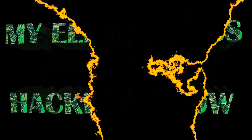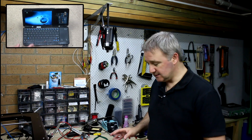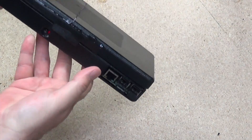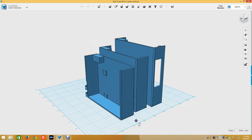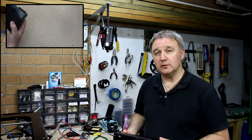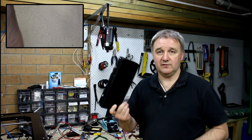Now for lessons learned. I have a habit of trying to print the entire thing in one go, whether orienting parts vertically to fit more pieces in or printing them flat. That does limit your approach and takes away certain options. I probably wouldn't do that again — print what you can, but don't be scared of having multiple parts that you glue together, because you have to glue a few together at some point anyway.